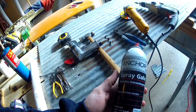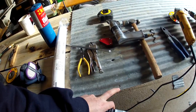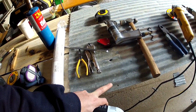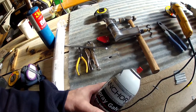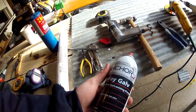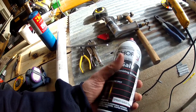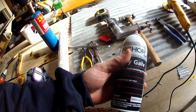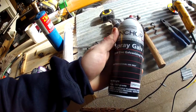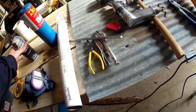Another thing I'm using is this right here — it's a spray galv, a galvanized coating in a spray can. Sometimes when I do my galvanized patch, it ruins some of the galvanized coating on the outside area of the patch, and I'll go back in with this and do a spray over it. This particular can I got at a welding store — you can see it's $10.90 a bottle, so it's kind of spendy. The official word isn't out on how well it works, but you'll probably want something like this to seal the galvanized coating.